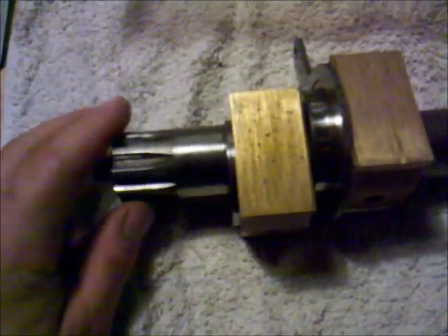I'm now reassembling the camshaft of this hydraulic pump with this pre-assembled repair kit. The repair kit, as you can see in this plastic bag, is already assembled and I will not split it because inside there are piston rings and I do not have the right piston ring compressor. So this must stay in one piece. I'm fairly certain I could remove these blocks here and put them onto the camshaft.